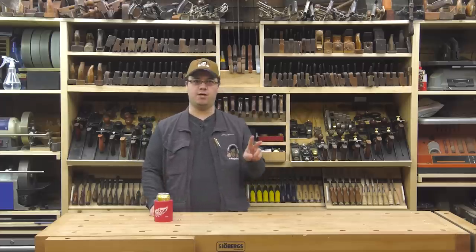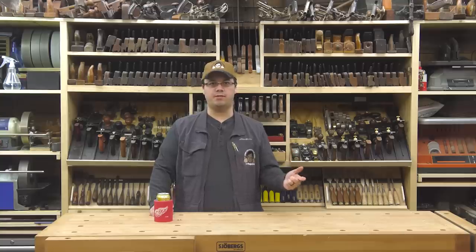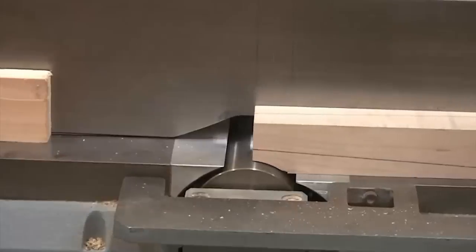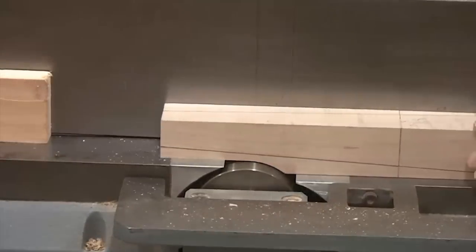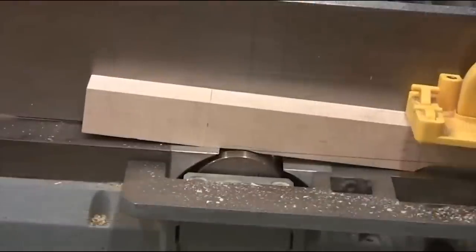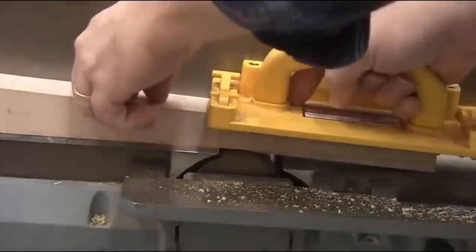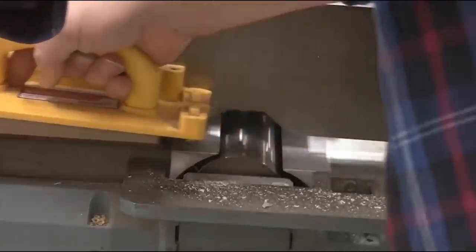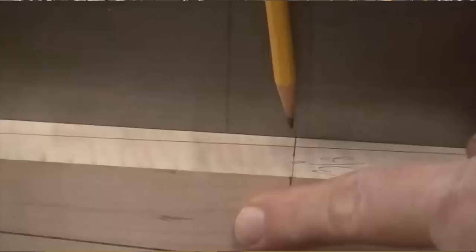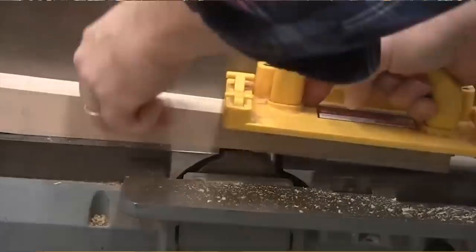When Chuck first showed me this, I had two questions — and maybe you're thinking of them too. Is it safe? And is it really easier than just ripping it on the table saw or band saw with a jig? On safety, he explained that the depth of cut is no more than you might take with a router table or a shaper — less than half an inch. The moment the cutter starts removing material, a flat surface is created and begins to expand on the outfeed table, so you have three points of contact, and while the piece is slanted, it is not unstable. As for efficiency, it takes a little more setup than a table saw taper jig, but it leaves crisper, more even shoulders than a table saw blade might, and a smoother surface than you might get with a band saw.